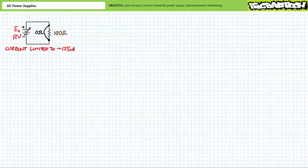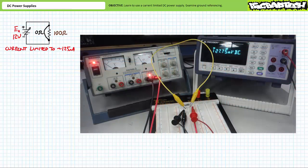Always a bad idea. However, given we dialed source A's maximum current down to 1/4 of 500 milliamperes, we should expect at maximum roughly 1/4 of 500 milliamperes or 125 milliamperes of current to flow. Allow me to demonstrate. The moment the short circuit is established, current spikes to roughly 125 milliamperes and ceases to increase. Importantly, 2 events simultaneously occur. 1. The overload indicator on source A illuminates, indicating source A is presently hitting the user adjustable upper limit, in this case 125 milliamperes.